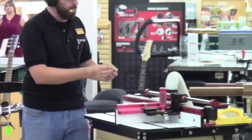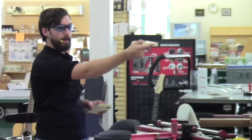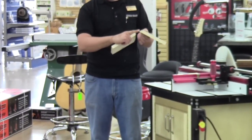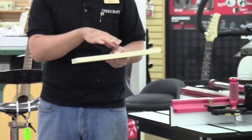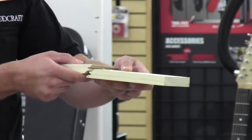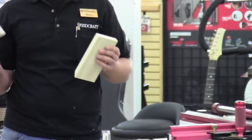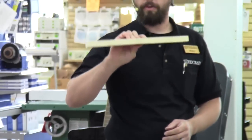There's the first cut — not worried about the tear-out. One piece to the right-hand side goes with the cut up, and the other is cut down. Slide those together and you're looking to see if these are flush. I don't care if there is still a flat edge on here — as long as they are flush, you know your height is correct. If it's not, the pictures in the directions will tell you: if this side is sticking up, the bit is too high; if it goes the other direction, the bit is too low. You can adjust a little bit and then do another pass — you have to start with a clean end, so again, lots of extra stock. Now that height is set and pre-done. From there is setting the fence. What you want to end up with is a knife edge — just take that edge off so there is no flat on there. I've set the fence back just barely and done that cut.